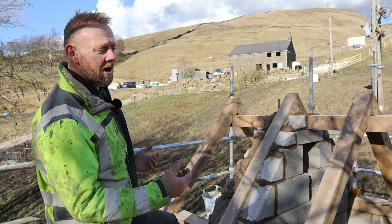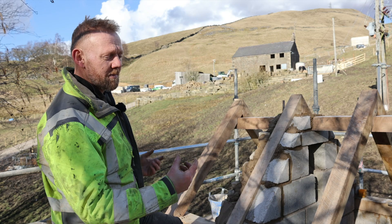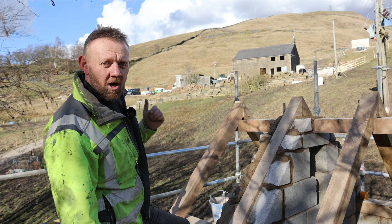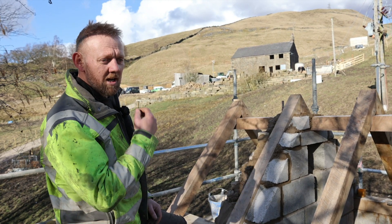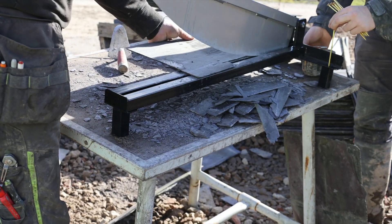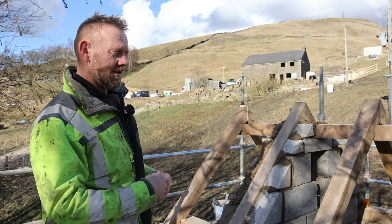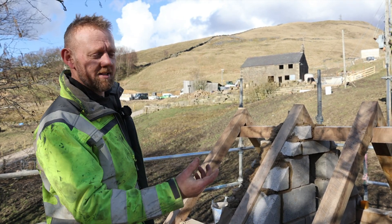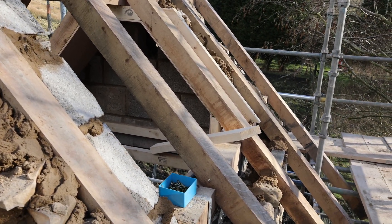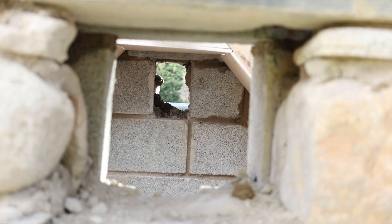For the next stage, we've cut down some 2x1 green oak in our joinery workshop to make oak battens ready for slating. We've got some lads up on yard cutting slates down — we've salvaged them off another job and they're trimming them to 18x10. We've got some type 1F membrane to go on this, because the bat people don't like us using woven membrane as bats get tangled in it. So we've got bitumen-based type 1F, and we've cut the 2x1 oak roofing battens rather than using standard green or red tanalised battens.